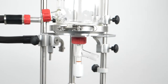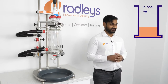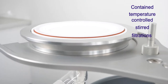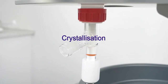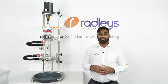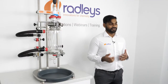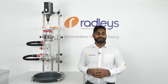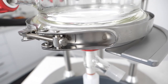The concept of our filter vessels is that they allow the user to perform reaction and filtration in one vessel, allowing for contained, temperature controlled, stirred filtration. This is ideal for applications such as crystallizations where you can perform your reaction, precipitate your product out in the vessel, and then your product can be filtered, washed and dried all in situ, saving you the hassle of transferring your chemistry into another vessel. Our filter vessels can be used for reaction workups or powder drying, and they can also be used purely for doing reactions or as a standalone filter.